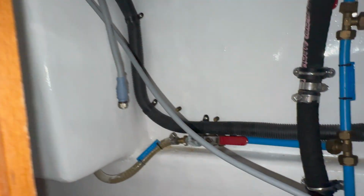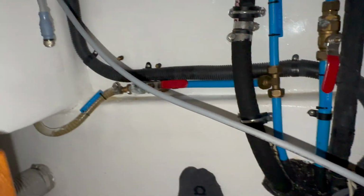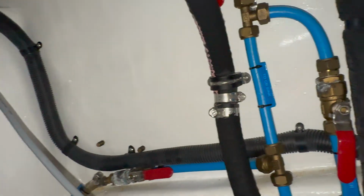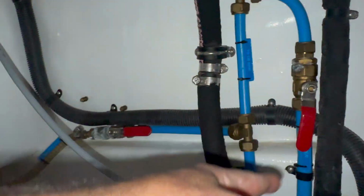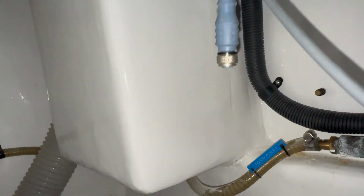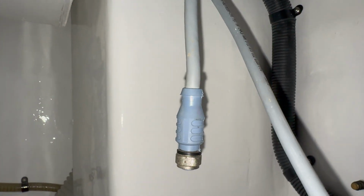Okay, the reason why we're running new comm cables is this boat is experiencing communication errors, and we've been chasing it down. The factory, when they ran this cable, they buried this harness or this NMEA cable in this boat, and there's no way for us to even service it. They left this cable too short, and they used a Garmin cable to make a T. Well, not a T, an extension, so it could go to the other cable.